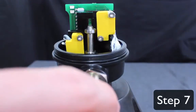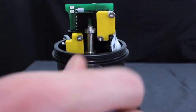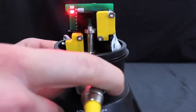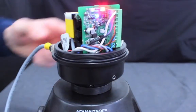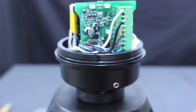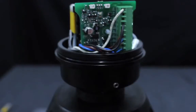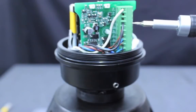Step 7: Connect the cable to pin connector if supplied. Note that the blue LED light on the back will indicate power. If not supplied, maneuver to the back of the switch and connect the power and feedback wiring to the terminal strip. Use the wiring diagram for reference to wire the terminal strip.